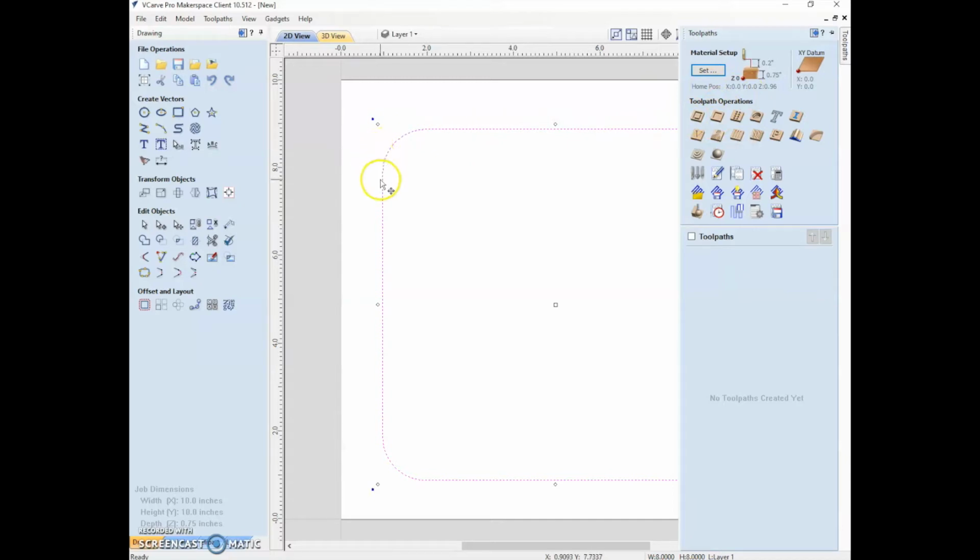And this might look similar from the Shapeoko when you're using Easel. And just as a note, with Easel, it does most of these things for you. It figures out a lot of these things for you. For example, we chose our datum to be on the surface of the spoil board. On Easel, that's not an option. You always zero to the top left corner of your workpiece. Similarly, it does all the feeds and speeds. We're going to be figuring that stuff out here.